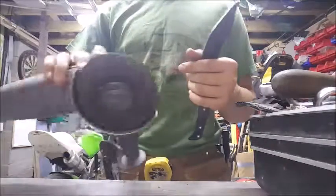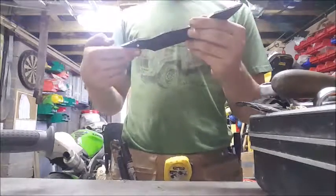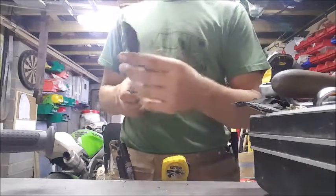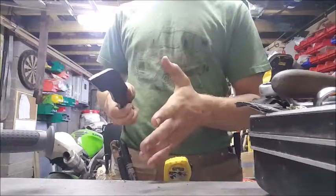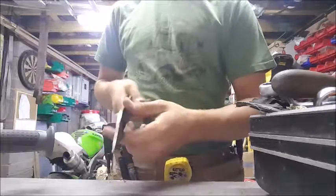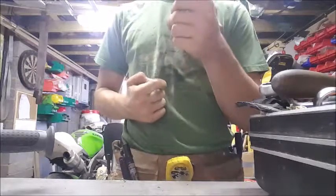I'm just going to grab an angle grinder, do it like that, because you'll never guess, I don't have any belts on my belt grinder because I go through them so fast and don't buy any more. So, yeah, in light of that, I'm going to grind the bevels in. And the only annoying thing about that is because it is forged, and more importantly, because I forged it, it's not straight, of course. The knife has a couple of bends in it. It's got fat bits, thin bits, all of that, but it's not too bad.